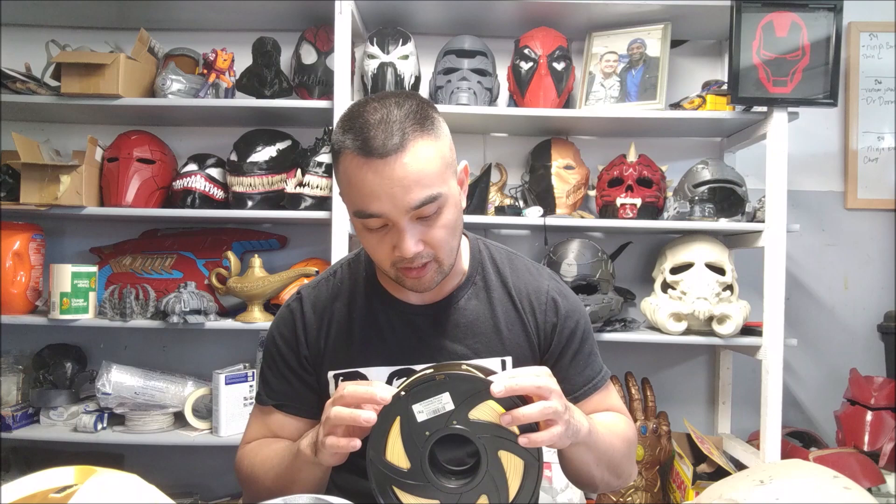It's super smooth, it's super soft, you guys — it's a great, great filament. Now, this is the one that was under-extruding. I printed another one on the same machine with the same exact file using Uncle Jesse's Gun Metal Gray, and I was right — it was my machine, because this one also under-extruded. This Infinity War Iron Man, though, printed on a different machine using the silk — look, man, this is nice, you guys. This is some top of the line, fantastic filament. It's super smooth, just like the first bottom part which was really good.